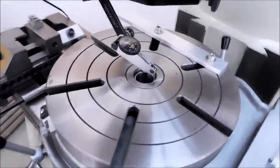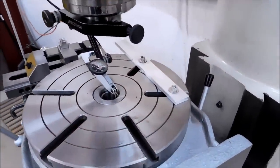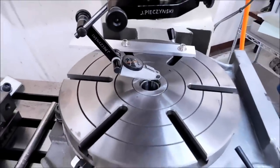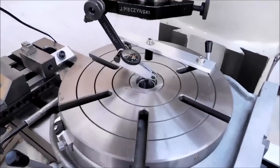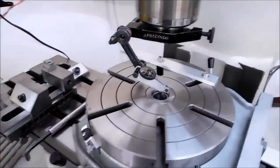All right, that being said, rotary table securely mounted to the table, and I have a fence on my rotary table that is indicated true in line with the x-axis. That just helps establish what's going on and a little bit easier for future setups. Let me mount this to a tripod and we will show you exactly how fast you can make a feature with this new little alignment pin. Works pretty good. Hold on.